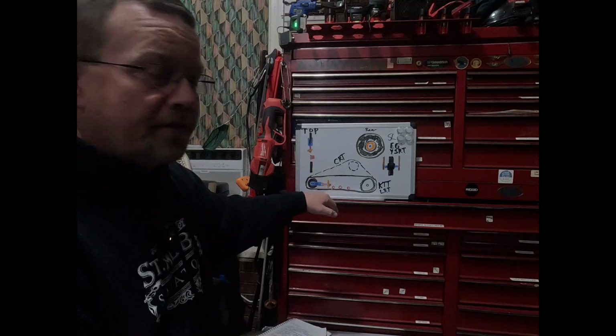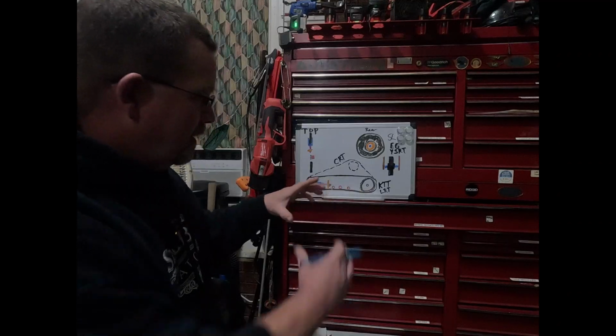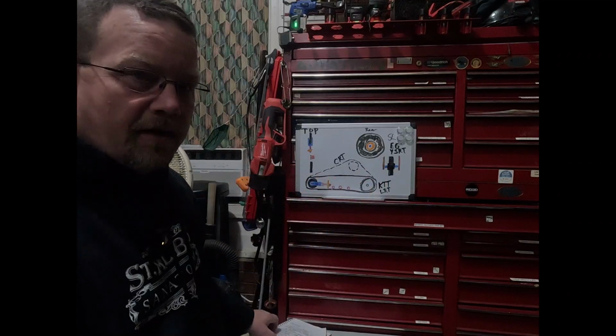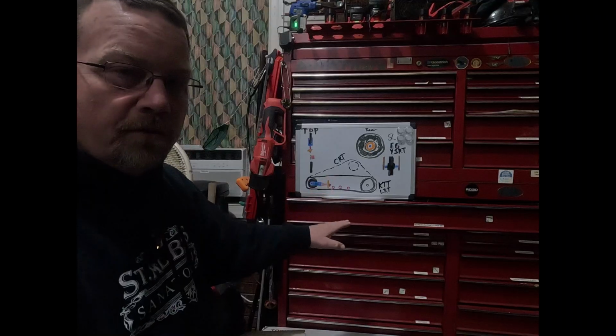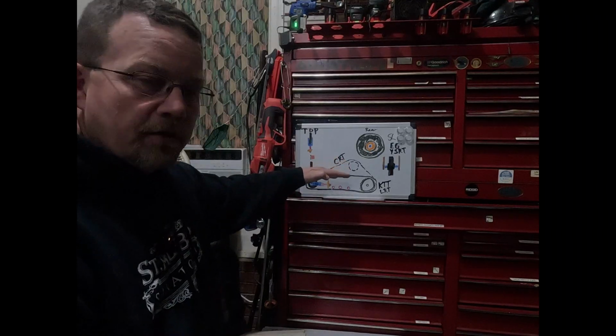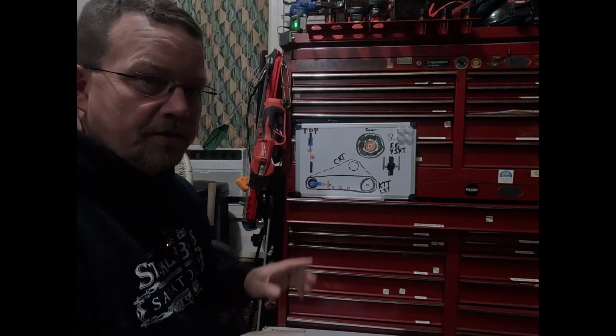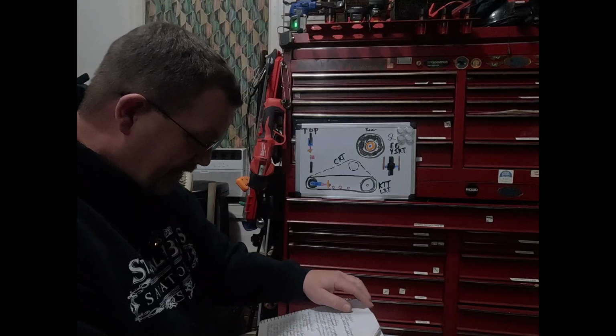Or you could have where this is showing you a lot of tension, but until you roll it, it won't set itself. So anytime you do track tension, you want to make sure that it is up off the ground, okay? Because you can get a false one. And it can also cause you an issue with overtension, and we'll get to that in a second.